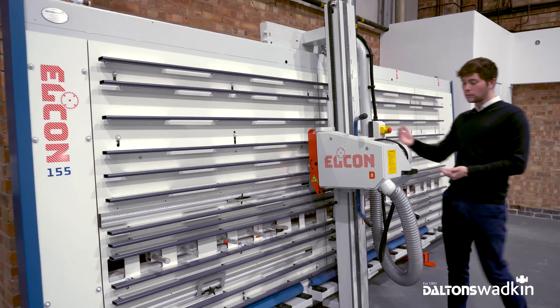As standard, the D is equipped with a series of transport rollers to help load your material without damaging it. You've got the entry roller and then the material transport rollers on the base of the machine. These are easily accessed by the foot pedal down on the left hand side of the machine. Rollers are up and in position now — just grab a board. It makes moving your material nice and easy along the length of the machine. Once in the desired position, you just drop the rollers down and you're ready for cutting.